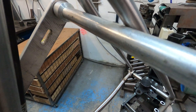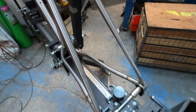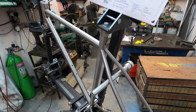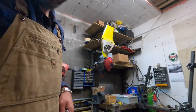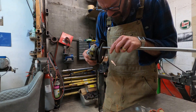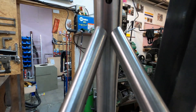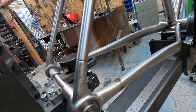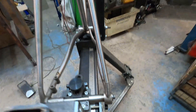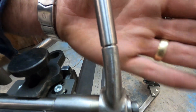See that - the stay is touching on this bar on one side but not the other, and on the back of the seat tube you can see it's all mismatched. So I need to take a little bit off the bottom. I'll use the vernier and scratch a line around the tube - that gives me something to aim for - then get the old angle grinder out. Took maybe a fraction too much off, but it's all right, we will fill it with welds. It's the beauty of this plug style that fits up inside the stay.